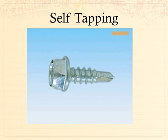Self-tapping screws are a fairly unique screw used for attaching some material to steel — it could be plastic, wood, or whichever, but they're meant for attaching stuff to steel. The tip of the screw, instead of being pointed with threads going all the way down, actually has a little notch cut into it to act like a drill bit. Tapping is the skill of putting threads into metal. That little tip drills the hole in the steel, and then once the screw catches in the steel, it threads the metal to draw the screw down into it. The head for a self-tapping screw is commonly hexagonal, with a little built-in washer on the bottom. They can also be called tech screws depending on where you are in the country.